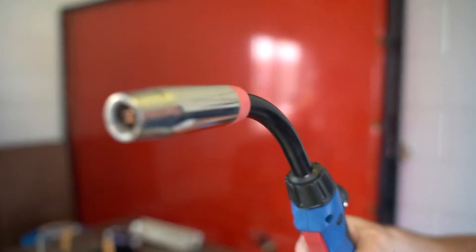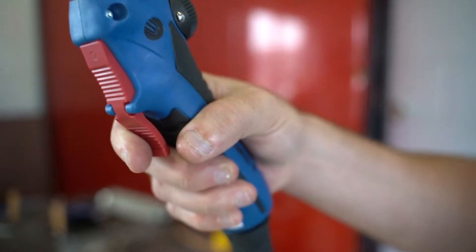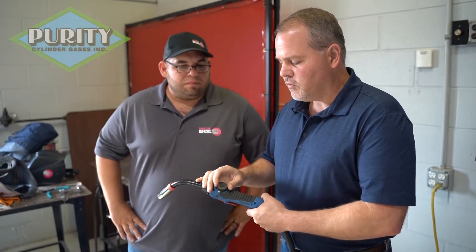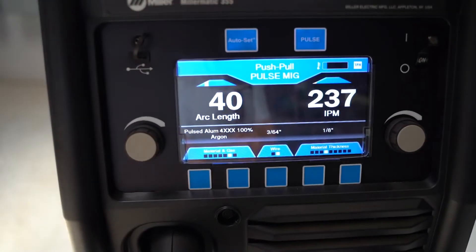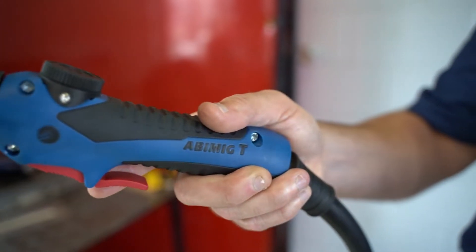The main benefit of this product, called Freedom Drive, is what we want to offer the welder over a traditional push-pull or even a spool gun — where it's big, bulky, and heavy at the front end — is this nice lightweight front end. This is developed with our lightweight cable technology also available in normal MIG guns, with savings of up to 50% of the normal weight of a cable. We do have a wire feed speed control on the front of the gun with the Lincoln and Miller versions, adjusting your parameters back at the welding machine.